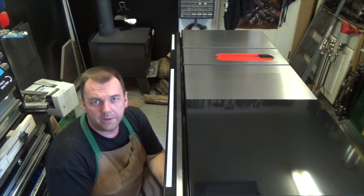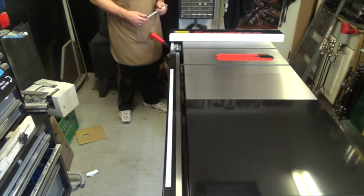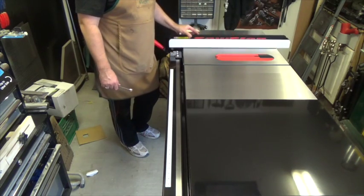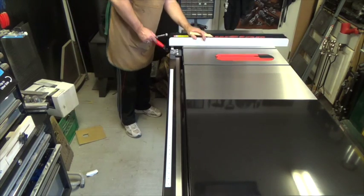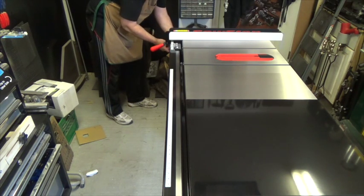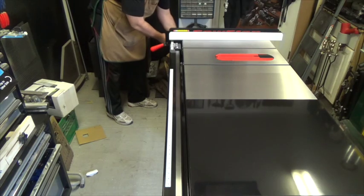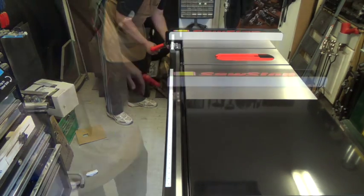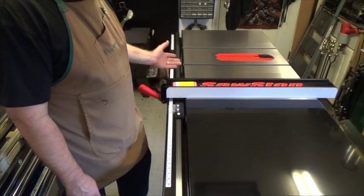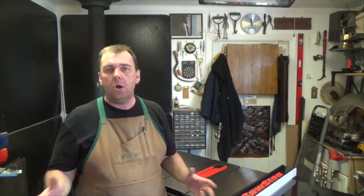Now we have to put on the front tube at the front end of the saw, which will accept the fence later. Go ahead and hand-bolt that into place, putting all the hardware from end to end — finger tight. Then for adjusting the rail, with the fence sitting loosely on the rail, slide it to the far left, lock it down with the 13mm wrench, and tighten that end of the rail. Then slide it to the right side and repeat the process. By adjusting left, then right, our fence and rail are adjusted and it locks down dead solid.